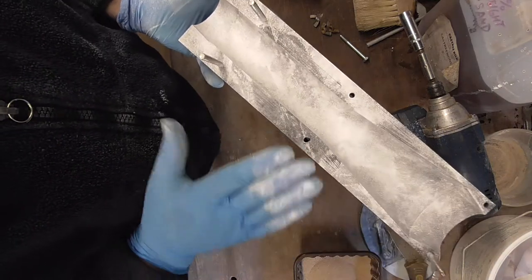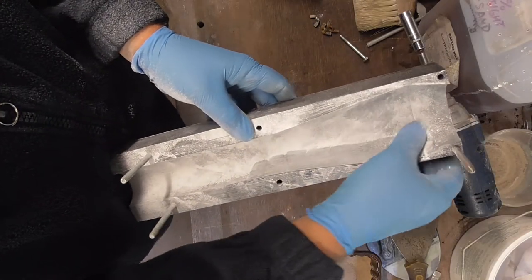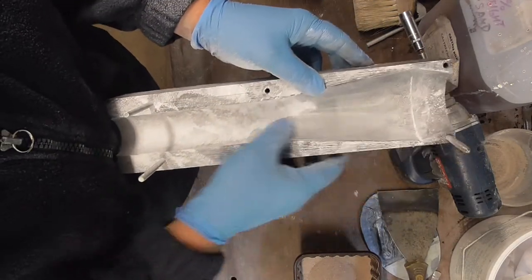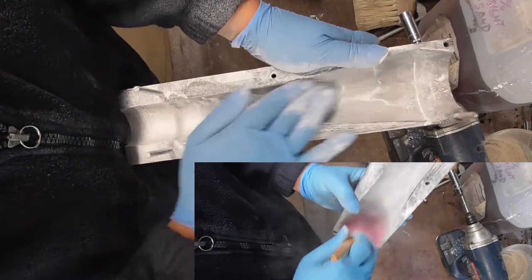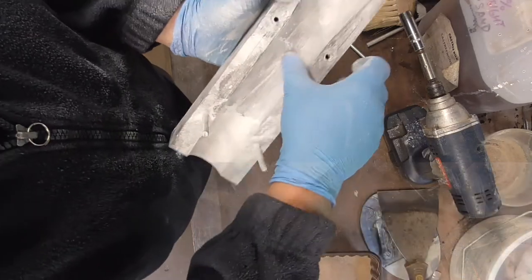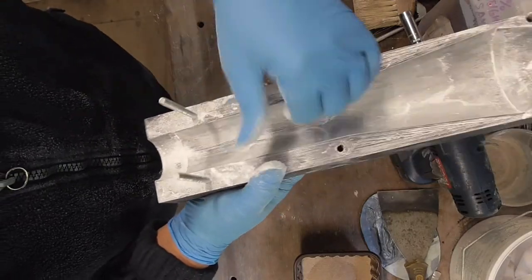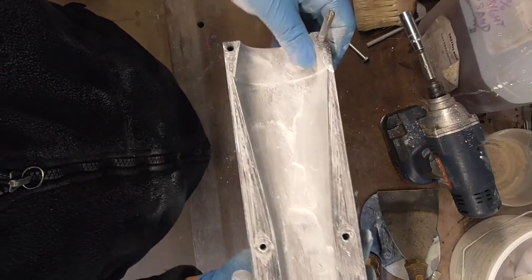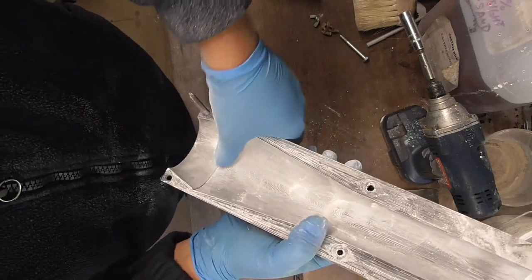So after I've sanded, parting powder, liberally put on, and then literally I rub it in. Did you like the word rubbing? Rub it in. Then what I do is I actually wipe it off with a brush. Really go to town and clean off as much as I can. And then I powder them again, and that's before I even use them. You find that the moulds get better the more you use them. So the first time is generally the worst, but I found parting powdering them twice with a rub in between helps a huge amount.